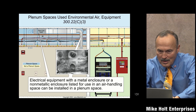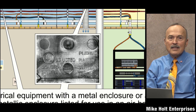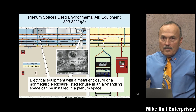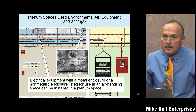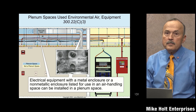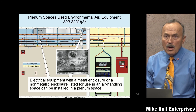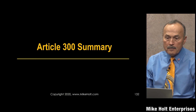I said 'you can't use that in a plenum' — but he showed me right there on the product: 'plenum rated.' So you can use non-metallic plenum-rated products. There are plenum-rated wire management systems that are all plastic, duct detectors marked plenum rated, and communications raceways marked plenum rated. As long as it's marked 'plenum rated,' it can be installed in a plenum space.